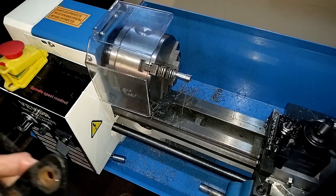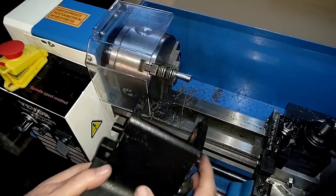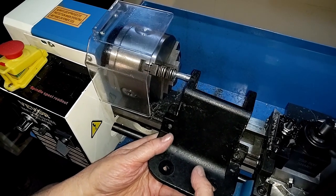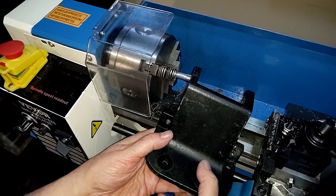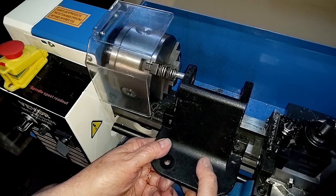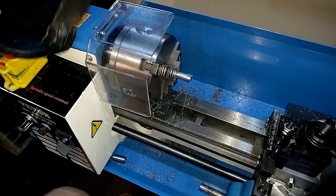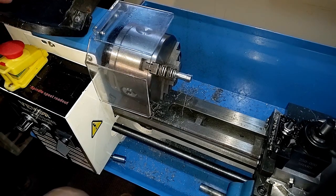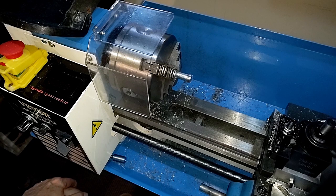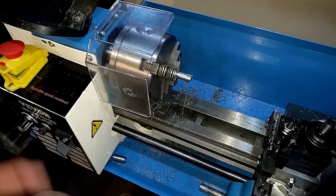And then the trick is, this is the hole that doesn't have one in it. And it fits very nicely. It's a little bit of a wobble, but it'll allow me to pull these easily. What I'm going to be doing at this point, of course, is putting a nut on the other end of that bolt, standing it off so the threads don't come in contact, and then use it as just a straight puller to pull this out.